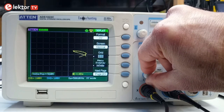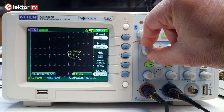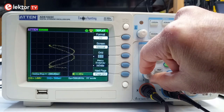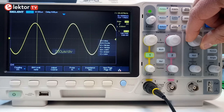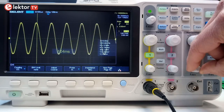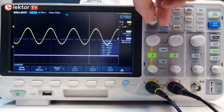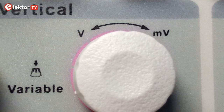So, now that we know a bit more about oscilloscopes, we can move on to learning how to use them. If you were smart and bought a cheap one, it will not have too many functions and so it is easy to get going. An oscilloscope displays the evolution of a voltage over time — a signal — and it does this in the shape of a two-dimensional graph with the center in the middle of the screen. Note that I said voltage and not current. An oscilloscope is a fancy voltmeter. Because it displays signals as graphs, an oscilloscope has controls to adjust the horizontal and vertical axis of the graph.